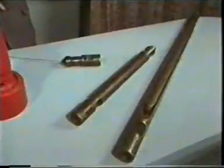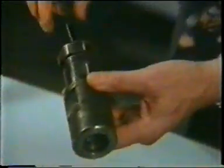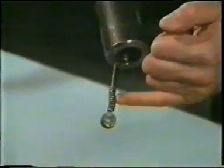Essentially, it consists of a set of devices that together make up what's known as a tool string. The tool string is joined onto the end of the wire by means of a rope socket. You pass the wire through and then form a knot.